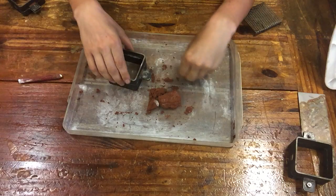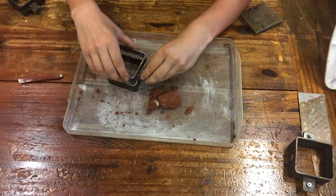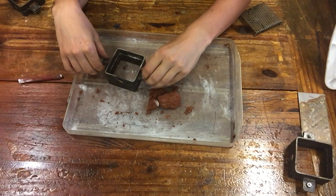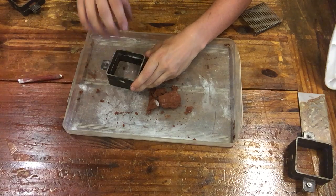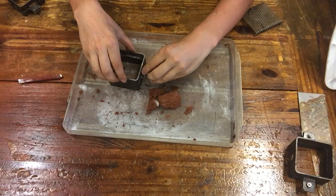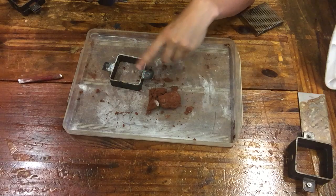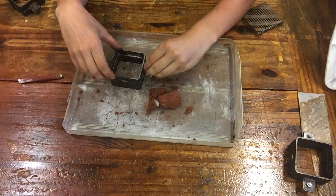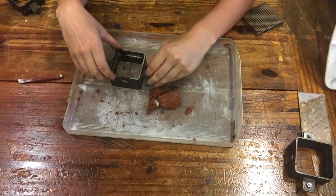The nice part is you can take it all apart, ram it up with sand, put your master component in, and then stick the top frame on. While you're doing your packing, you can bolt the whole frame together. When you're ready to remove the master part — the core part in the mold — you can unbolt it, take off your top frame gently, and make sure everything's exactly the way you want. Line your frame back up, bolt it back together, and you're ready to do your casting without any muss or fuss.